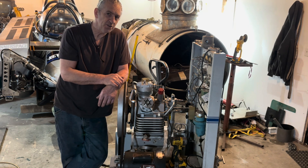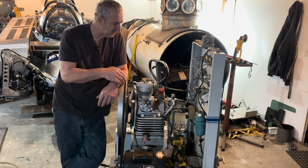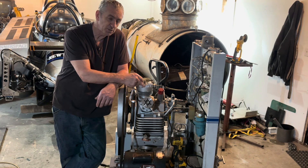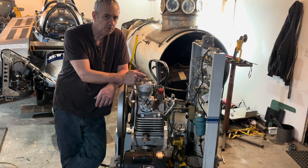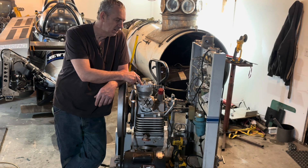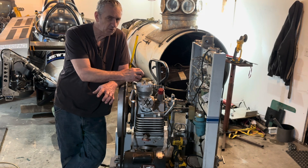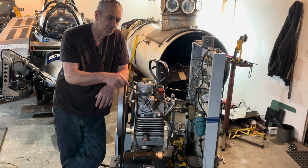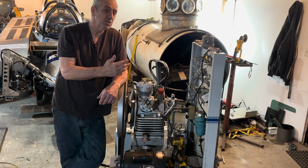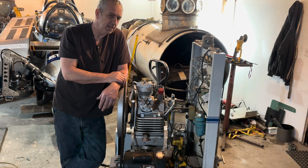I figured I'd rather spend a day or two playing with this — besides, it's fun to go through it all and figure it out. It's got good oil pressure; it's got both a pressure oil pump and a splash pump. I have to be careful because apparently they have to run at 1000 rpm to properly lubricate. So I run it very intermittently to test things, at least with the electric motor, because it's not geared and I'm not getting it spinning fast enough. But it's spinning fast enough to do the testing, so fingers crossed I can get this working.